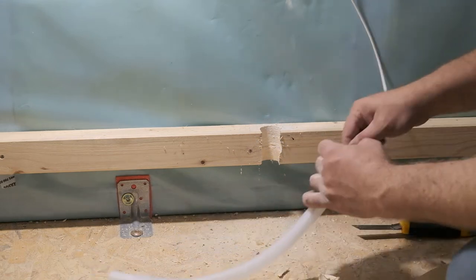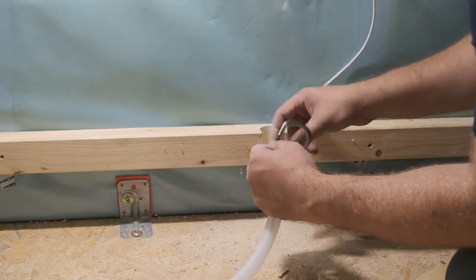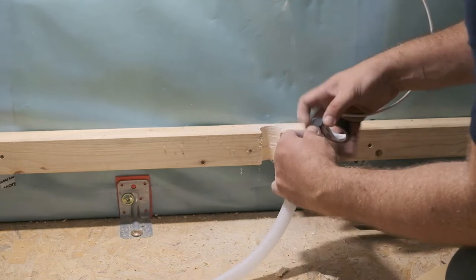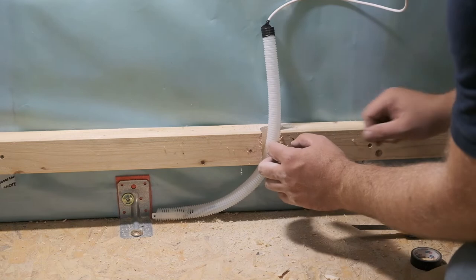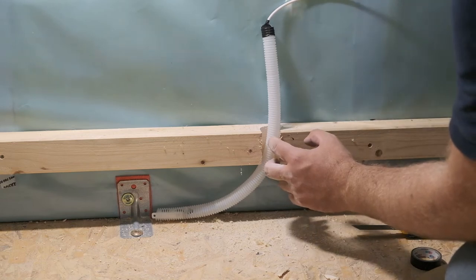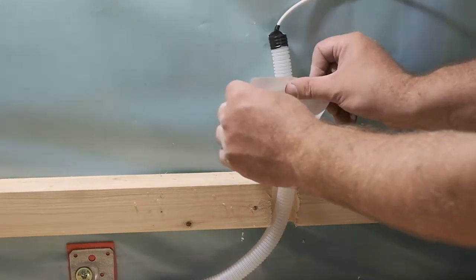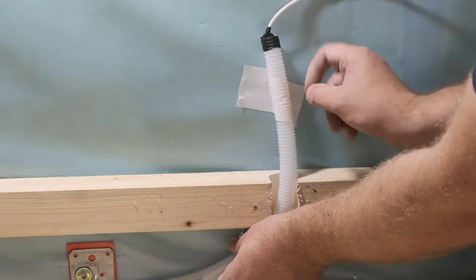above the floor level. A revision opening or electric box into which the protector will be led should be prepared here. Should there be a suspected leak, this will allow us to remove the sensor with the cable, to check the space via the protector using, for example, an endoscopic camera, and to return the sensor with the cable back to its original location after the inspection without the need of any demolition works.